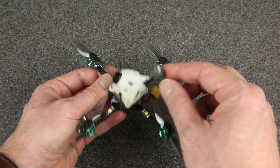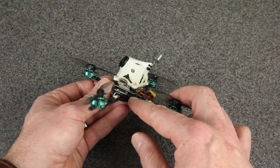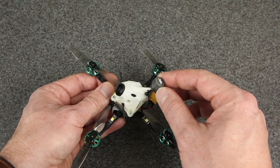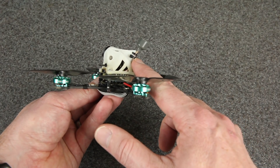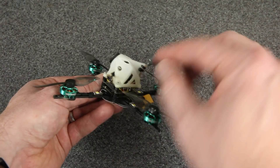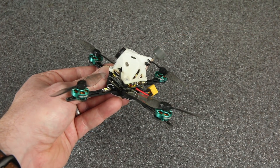The other antenna at the back is a left-handed antenna for the air unit — this happens to be a TrueRC Singularity. I'm running it out the back with a pair of tiny zip ties holding it to the fin so that if it moves it doesn't yank on the UFL connector.